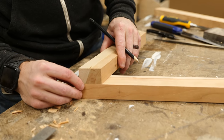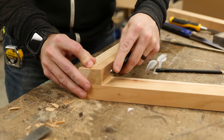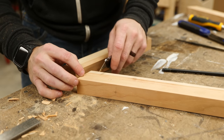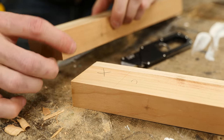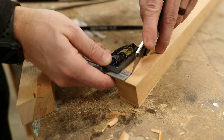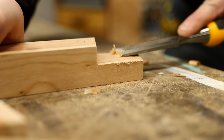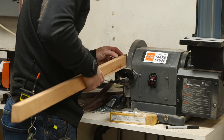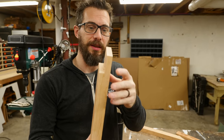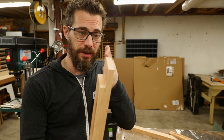To get these pieces cut out I'm going to lay them in the position that I want them to be in, then label them so that I know which two corners of these two pieces go together. I'm going to use a knife to make a little score as close as I can to this piece along that line. I can then transfer this line to the other sides so I know which section to cut out. The bandsaw has a little deflection in it so my cut is a little bit different here than it is in the middle — you can fix that with a chisel and some sanding, or you may need to adjust the tension on your bandsaw to get rid of that deflection.